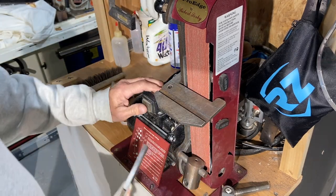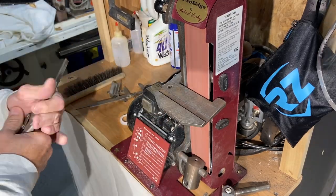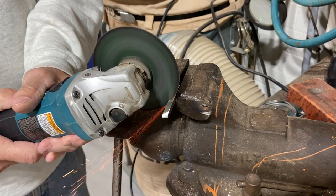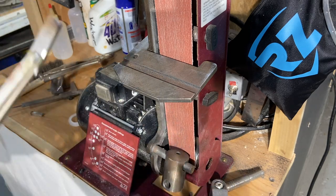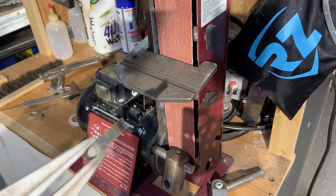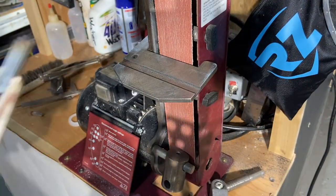So I have a round cutter, and then I'm going to turn it around and do the other side. This is a nice round cutter. As you can tell, we've got a square end on it, but that has to be rounded. This is metal, because when we get done here, this is that piece of metal that I'm going to trim and grind down a little. It's going to get very hot. If you stuck it into one of these plastic ones, it's going to melt it. So I got a metal one, and I'm looking for the quarter inch — right there, quarter inch — and I'm going to get that end to fit into that quarter inch.